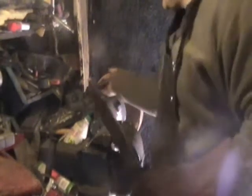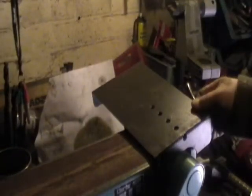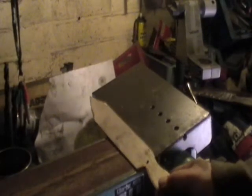Now the way I do it is I've got a drill vise, and I put it in this vise and hold it all horizontal like that. So the blade, to me, is that way on. Alright, so I'll get grinding. And obviously the other way of grinding is on a belt grinder. I've got my little naffy bracket there, which helps me put an edge on here. So I'm going to tidy it up. Dipping it in the water there, to cool it.